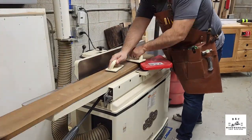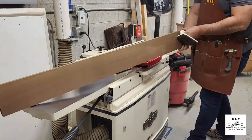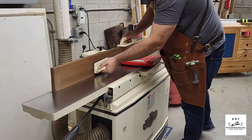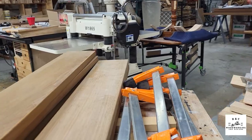Both of them are exotic hardwoods, and they're great for outdoor furniture because they're bug-resistant, mold-resistant, and rot-resistant. When I made this video, the cost of teak was around $40 a board foot, and the cost of Ipe was around $14 a board foot. Being that they turned out pretty similar in the end, the customer decided to go with the one that was much less expensive.